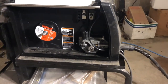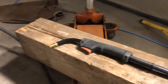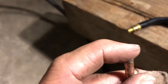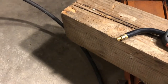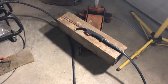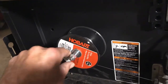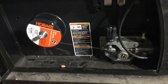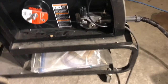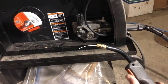A couple common problems that can cause wire jams: you can get slag in your stinger tip, which can block the wire and cause it to clog in the wire feed. Also keep the whole line in big sweeping loops — avoid coils or kinks, as that can cause jams. On occasion a tight spool can also cause a jam. In this case it was something from the tip forward. I got the line cut back, fed in, and we're good to continue.